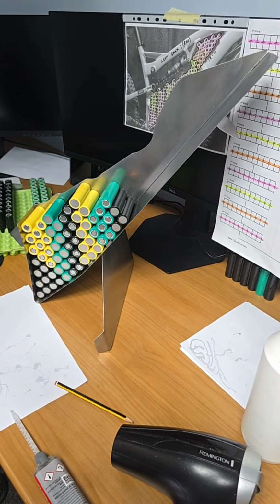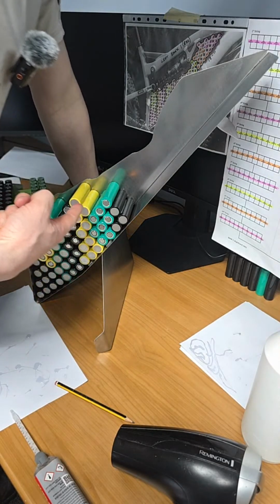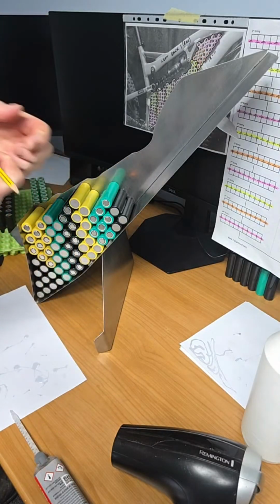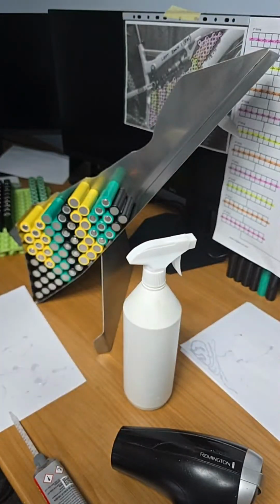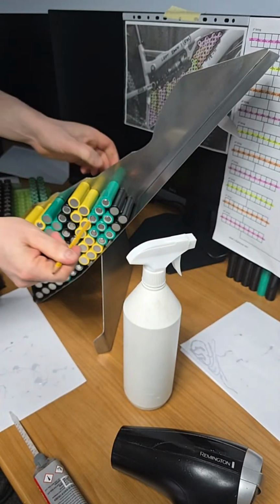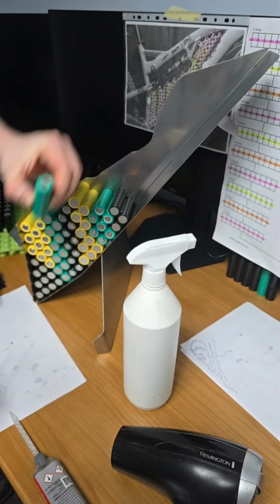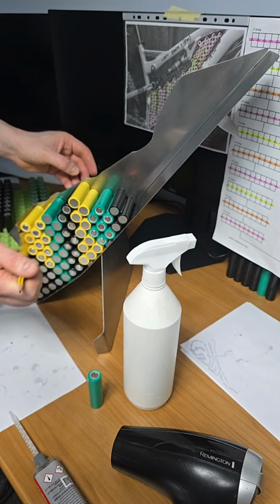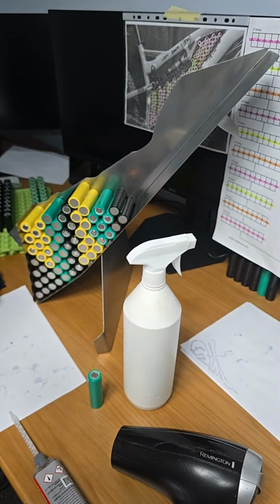Okay, so I'm moving further up the pack here. So before I place the next cells in here, I just need to make sure that these cells are glued, and I also need to make sure that I clean the end of this pencil. I need to make sure that these cells are tight to the back wall. This one's not glued yet, so I'll take it out. Tap these ones to the back wall. Make sure the glue's nice and neat, which it is.